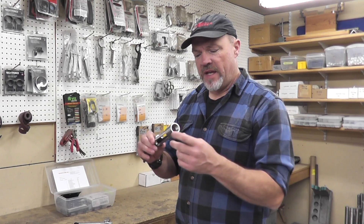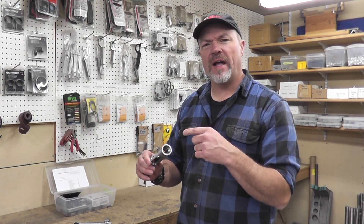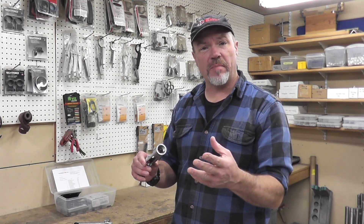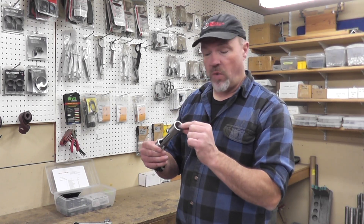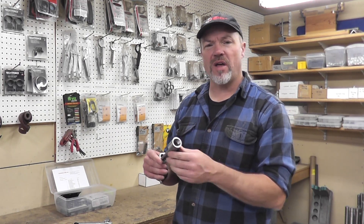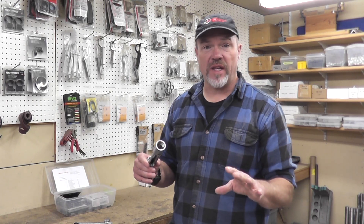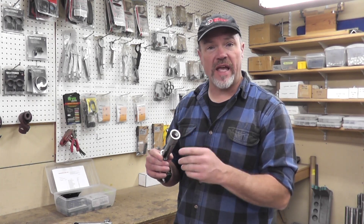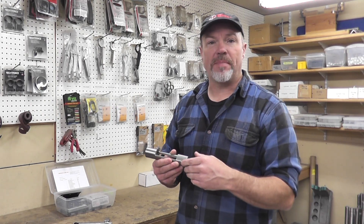The next thing we're going to do is modify the bolt. We're probably going to flute the bolt body because I like fluted bolt bodies to match a fluted barrel. If we're going to put on a slick barrel, I would leave the bolt alone — I kind of like them to match. We're going to come in and square up the action face, and square and true and blueprint the entire action. We're not going to get into how to do that because this is not a how-to video, but we'll show you the results when it's done and then move on to other action modifications in further episodes.